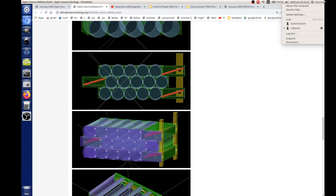So they're creating their own PCB boards, which hold 7 18650 batteries. They're building these boards so that the mounting holes also conduct current. They have brass standoffs that they screw to stack these together, and those are the bus bars themselves. They have these plastic battery holders that they mount on, and they solder all this together. There's a connector for a BMS, so a whole stack of these will have one BMS to manage all of the cells in the array with ribbon cables.